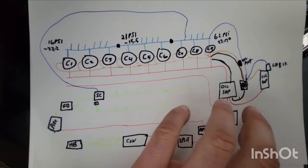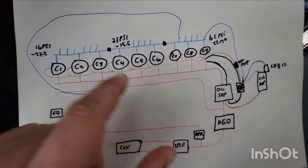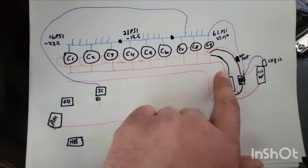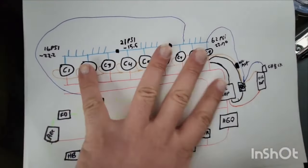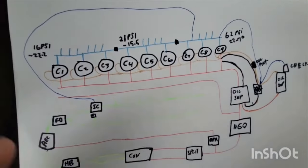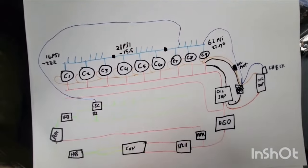Is that cold or cool? Is everything red on the discharge side, is that hot? Is everything this yellow and green color lukewarm? So discharge hot, liquid lukewarm, and suction cold. If you find something warm that's not supposed to be warm, or cold that's not supposed to be cold, then you need to trace out where that is coming from. Is it a hot gas differential valve or whatever?